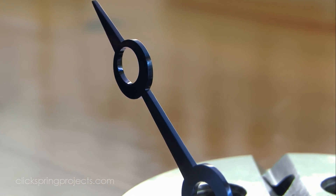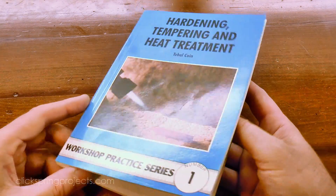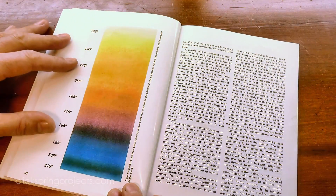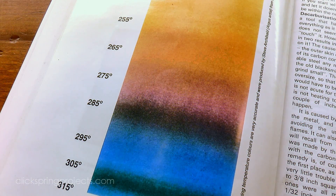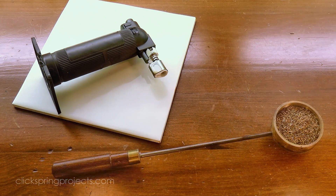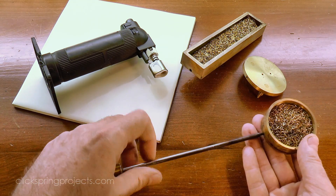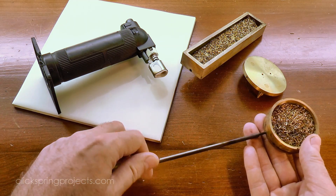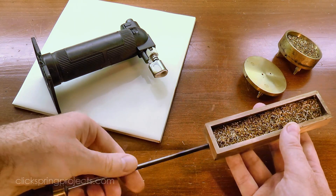The result is not just a pretty blue colour, but also a very reliable proxy for determining temperature, which we are going to use during the tempering process in a moment. With a bit of the science behind the process in hand, we can make a few statements about what factors will affect the quality of the final blue colour. For one thing, a uniform oxide thickness would give a uniform colour, so we'll want to heat the part as uniformly as we can.